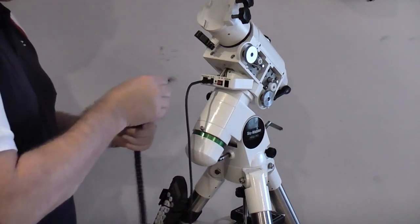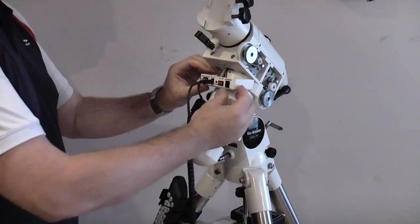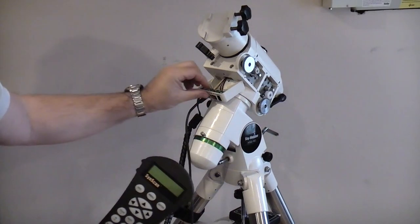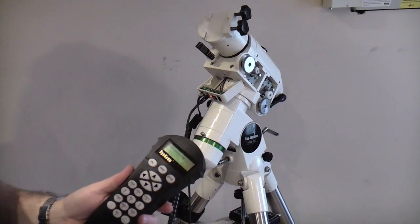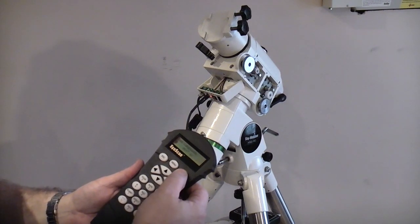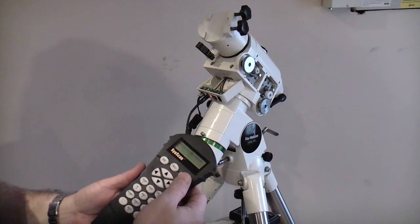It's a little bit hairy this, you have to be just very careful. You're dangling the box on its wires and then hanging a weight off it. So just be very, very gentle with it so as not to stress those wires too much. I'm just going to run it 45 degrees just to make sure I'm absolutely happy before I put the electronics box on, because as soon as that's on, of course it's covering up one of the two adjustment grub screws and we can no longer adjust the backlash.